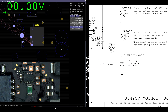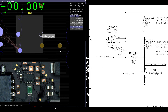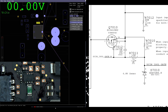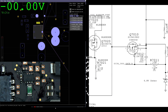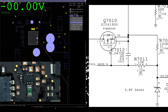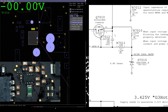18 volts. Next up, we're going to check the output. The output is pin 1, and that attaches to R7020 pin 1 — and that is the drain. We get 0 volts, which means this transistor is not opening. Now, this is a P-channel transistor, which means it's going to open when the voltage on the gate — pin 4, where it says G for gate — is lower than the source, which is S, pin 5.